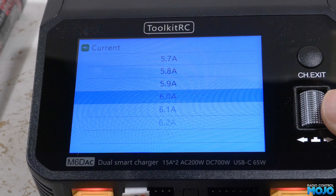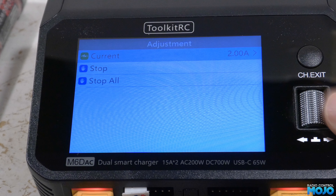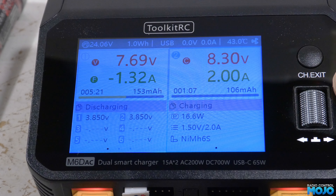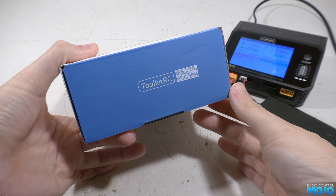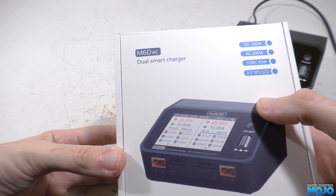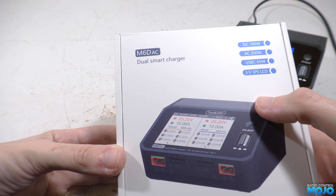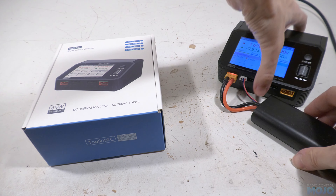Just a super quick look at some other features: the charger can discharge one battery into another, using the second pack as a sink for fast discharge. You can also set up the outputs as a variable voltage bench power supply, which is very handy for running projects without running down your batteries. It can also cycle batteries automatically — discharging and recharging — which can revive some tired packs. I'll need to use it for a few weeks to get a good feel for it, but so far it looks like a good solid unit. If you don't see a follow-up video, chances are it's still doing its job. Thanks for watching — like if you like, subscribe if you haven't, and leave a comment if there's something on your mind.